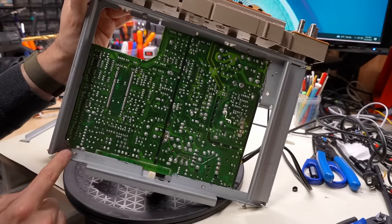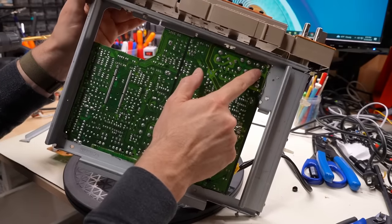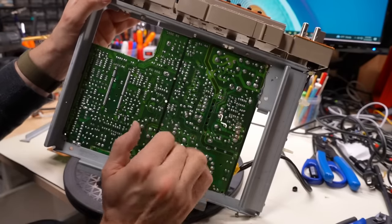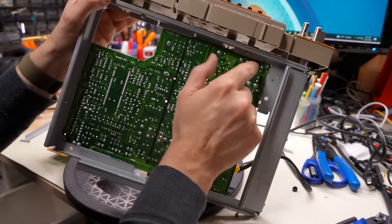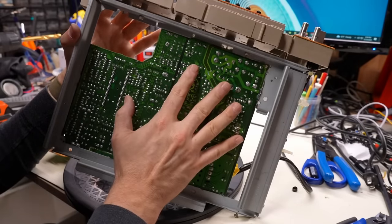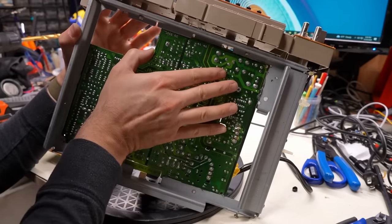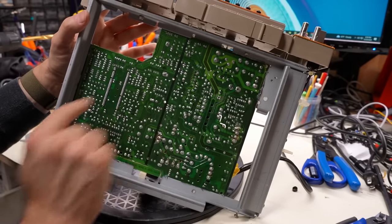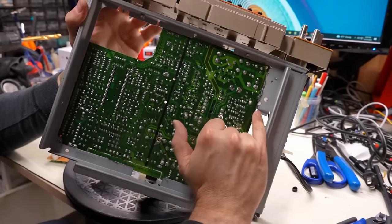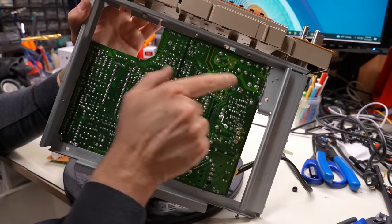The board is now mounted in the chassis. Removing the metal wasn't exactly easy — I started with the Dremel but it was taking forever on the thick metal, so I went outside and used the angle grinder to cut the majority of it, then finished with the Dremel. After removing those metal parts I test-fit the board, trimmed a tab that was too close to some pins, and the board is in there. Unfortunately I was only able to use one screw hole. I cut away another area where the metal was too close to mains pins, then used hot glue to prevent the board from shifting around.